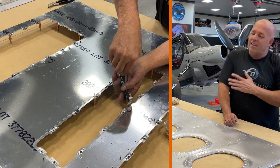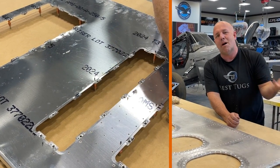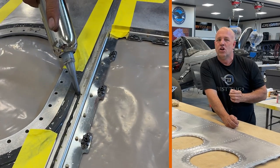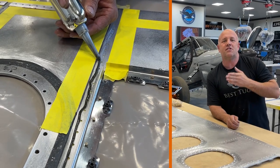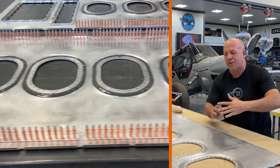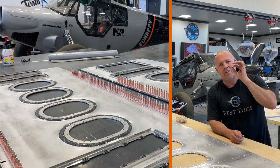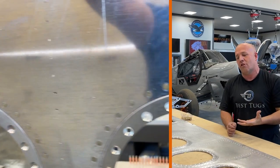Now, a lot of stuff I assume is common sense, but I'll give you one of the ones that came up on one of my last videos. Just to make sure you all know, whenever you're connecting any kind of tank with any kind of sealer, you want to do it wet and keep it wet through the whole process. Some of the sealers are air dry and they'll seal off way too fast and you can never finish a project this big. So you've got to go to another sealer that takes 24, 48 hours or more to cure up, because you don't want the skim coat on the top to get dry at all. You want to stay wet during the whole process.